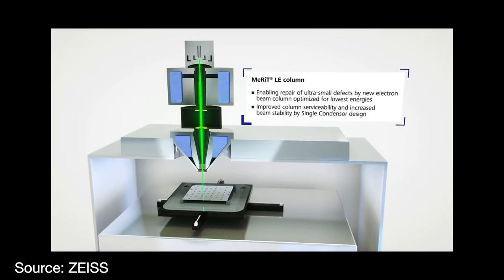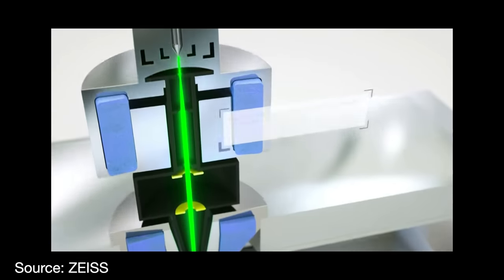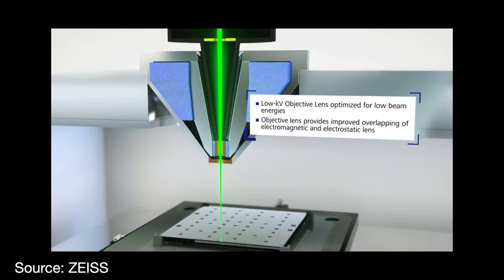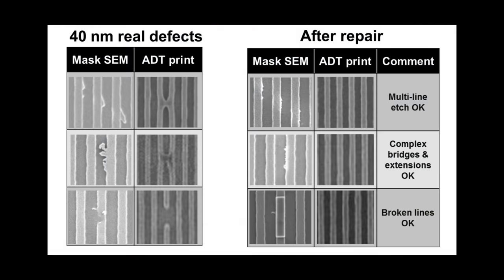It is kind of like welding at an atomic level, where a precursor is laid on the sample and then struck with a beam of electrons from an electron gun. Depending on the type of defect, you can either add more absorber or etch away absorber. And oh yeah, the repair has to be done entirely autonomously in a vacuum to prevent any contamination.